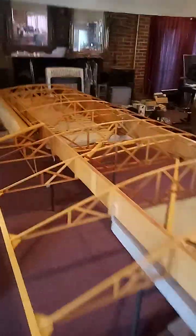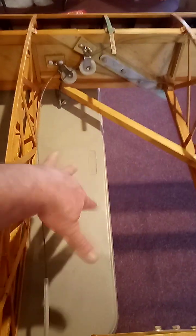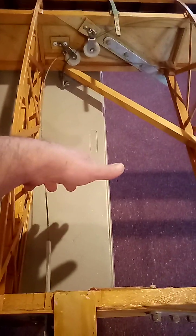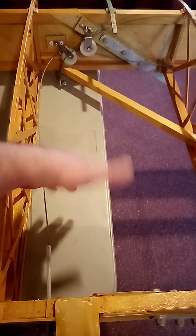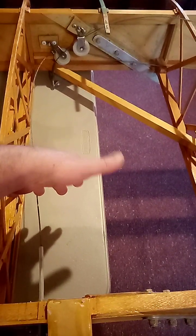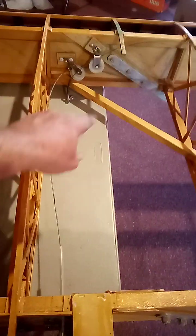TXK Flyer came to the rescue because I hadn't actually thought of this. On the differential ailerons, I went through all the trouble and figured out a way to get a bellcrank across here that's 90 degrees, with these two pulleys. The pushrod crank itself would also be almost 90 degrees, but it had to be adjustable like 10 degrees to get my differential — a whole lot of modification.